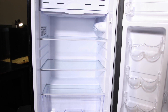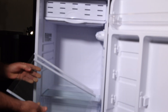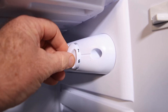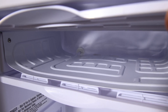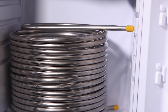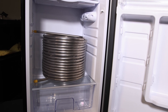Here's what the fridge looks like inside. The first thing I did was take out everything I don't need. Here's the freezer at the top and the temperature control. On this mini fridge, this is where all the cooling work happens — in these little coils in the freezer. The stainless coil fits nicely in both directions, so I have options on how I can plumb it.